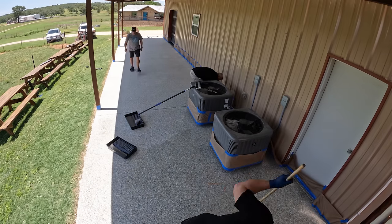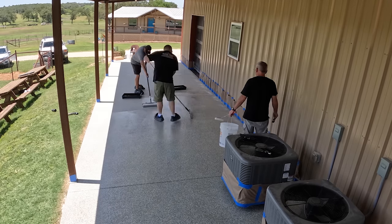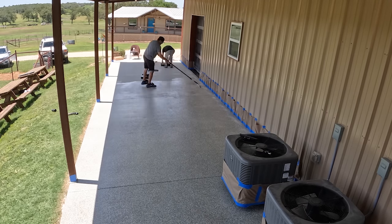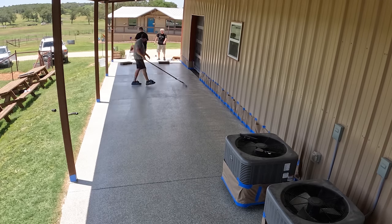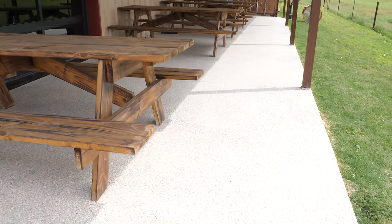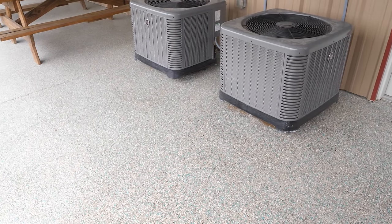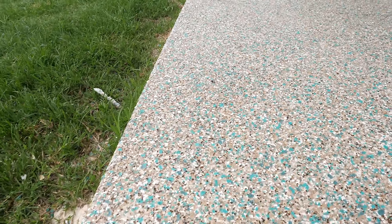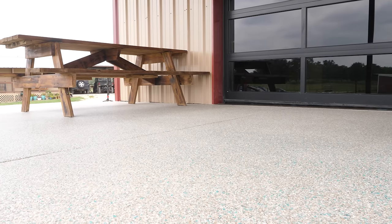We've made it to the final step of our flake flooring system — the polyaspartic top coat. Since this is an outside application we went ahead and did two coats. Pro tip: when applying it, use a chip brush and squeegee out those grout lines — we don't want any buildup of poly in there because the product doesn't cure correctly in a large mass. Make sure to rub that out so it's nice and consistent with the rest of the top. Here are the final results — let us know in the comments what you think. When you get this quoted from a contractor they're typically weeks if not months out and the cost is insane, so this is our DIY version to make it easier for the homeowner to do themselves and hopefully save you a lot of money. Thanks for watching — from all of us here at Stumco Countertops, you got this and we'll see you on the next video.